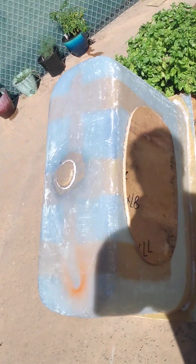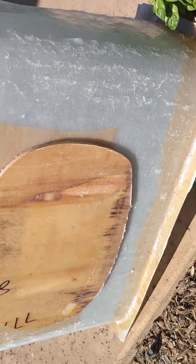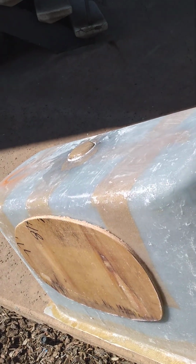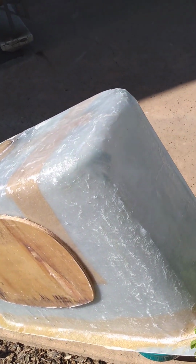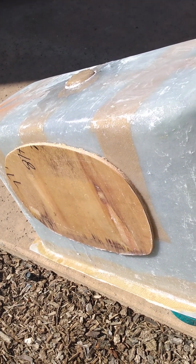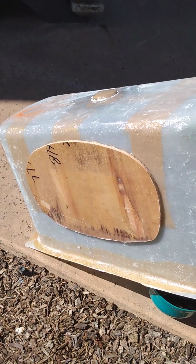It's just that you have to build the mold right from the beginning. And that's the end result, and it came out beautiful. Kevlar reinforced on the flange. Chop strand mat, 6-ounce and 4-ounce glass, epoxy resin. Nice stiff walls from the wood I bonded onto it, and I'm really happy. We'll get you a video when they're all plugged in and running.